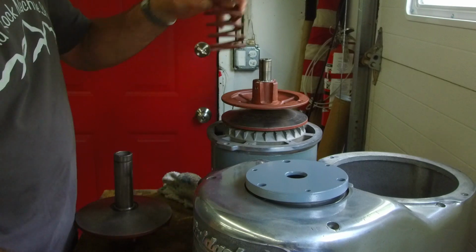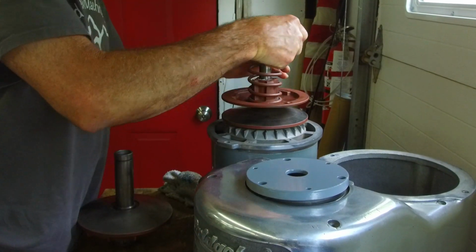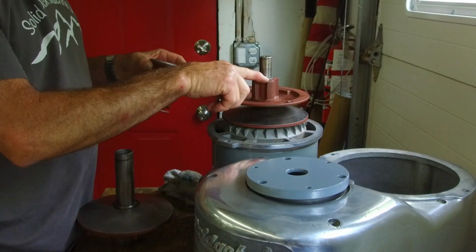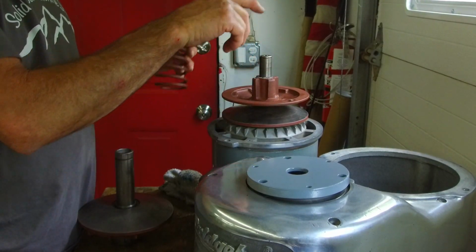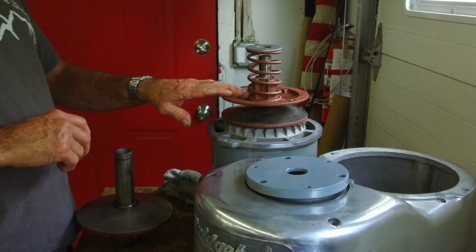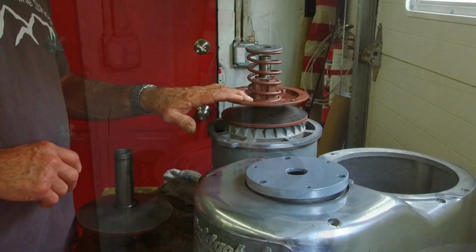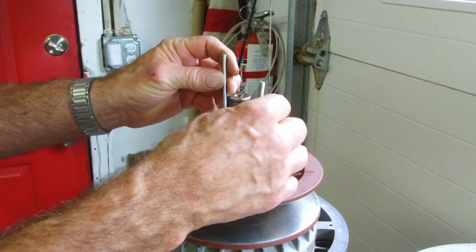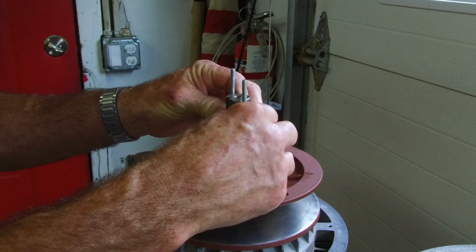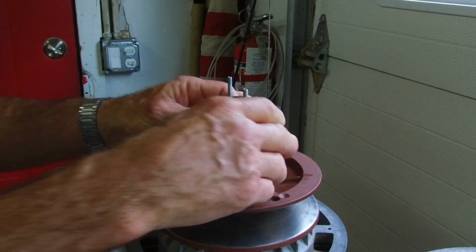So we will be putting that spring on, and there. We want to make sure that our holes are tapped out and free and clear and ready to accept those all threads. We forgot if we have done that since we painted this. Anytime we do sandblasting and painting, we clean out our threads with a tap. Okay, we tested our holes and they are free and clear.